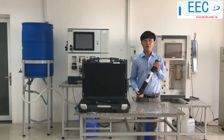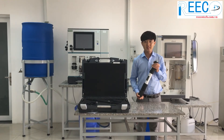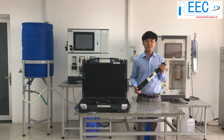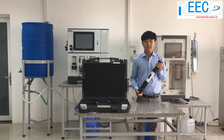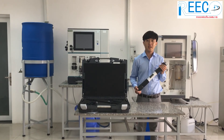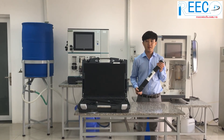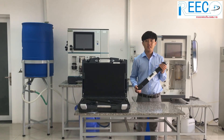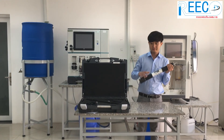I will show you how to store the equipment. When you store your device for a period of several weeks without operation, please proceed as follows: generally charge the battery completely before storing the device. Get the device out of storage every 2 or 3 months, charge the battery for about 6 hours, then discharge the battery by starting a continuous measurement. Let the measurement run until the battery is empty and the device switches off automatically. Charge the battery completely before you store the device again.